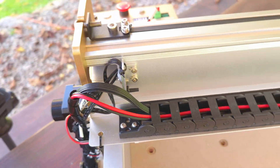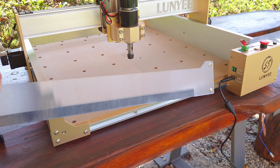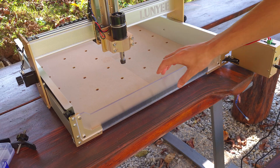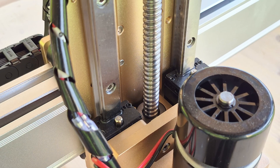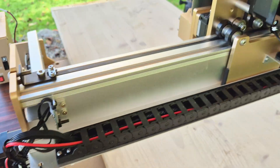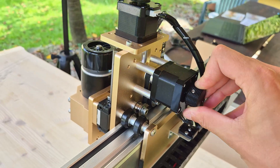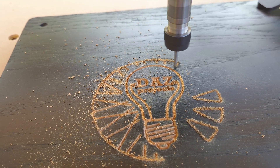I've had zero issues with them, but I would have preferred proper limit switches. The front and back panels are held on with magnets, making them easy to remove if you need to work on material longer than the 400 millimeter bed size. The control box swings out of the way so you can use the full width when needed. In terms of motion, the Z-axis is ball-screw driven, which provides accuracy and rigidity, while the X and Y axes are belt driven, which is faster but offers far less rigidity and precision.